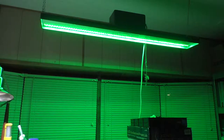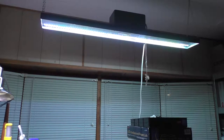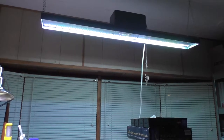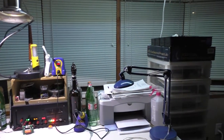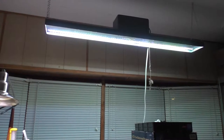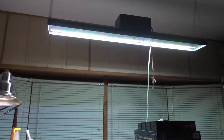Now here's the thing about RGB strips. When you put them into white, that's a pretty nice white on camera, but what you're actually getting is each little bulb lighting red, green, and blue together to get the white effect. These bulbs have red, green, and blue together on the same actual LED, so it's not so bad — but some strips have a separate red, green, and blue bulb, and you won't get the white effect as nice. It does look really good on camera, but when I look into the room it has a slight greenish-blue tint. The strip I'm going to replace it with is going to look a lot nicer.